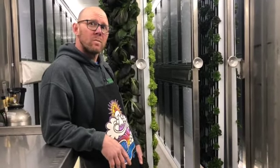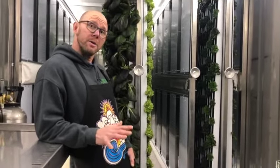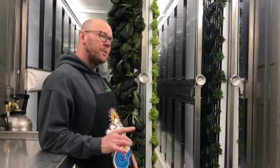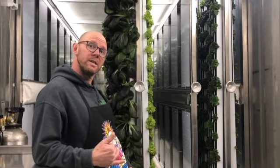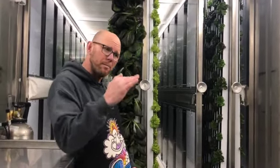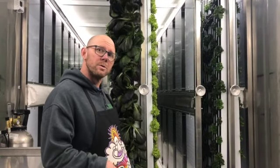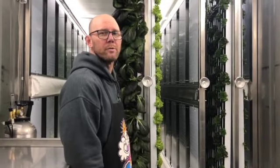One question was about temperature, and I want to add humidity too. This farm has a brain — we can run it from a computer or an app on a phone. Our temperatures during the day are 70 degrees, since we're primarily growing lettuce, with a high of 70 and a low of 60 at night. Humidity is set to about 55%, fluctuating around that average. All those are controllable parameters. Once we set them, the farm takes over — the nutrient delivery system, heating and ventilation, and lights all work together to create a perfect environment for whatever product you're growing.